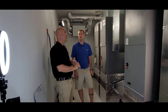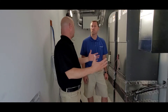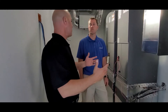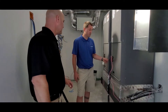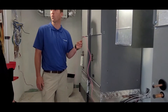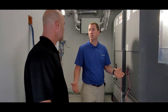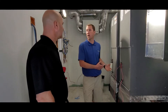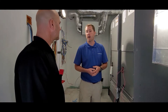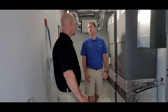We made our way to the upstairs mechanical room. We were out earlier downstairs talking about this being a J-Series application, and you're an elite contractor with the Halcyon product line with Fujitsu. The major difference between a J-Series and a Halcyon system is really just this pink wire. This is our communication wire that we run to each controller on the wall and between each air handler. The only other difference is the line set — the way we run it. There's only one line set from the outdoor unit into the indoor unit, and then we have separation tubes. That line set splits and a separate line goes to each indoor unit, so it's overall a lot less copper to run, making the installation actually quicker.